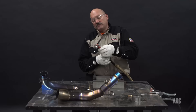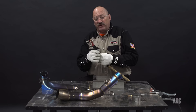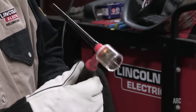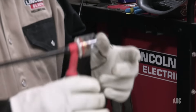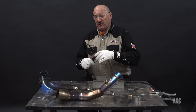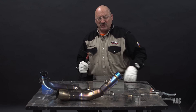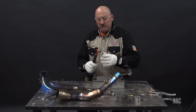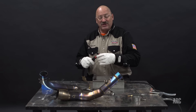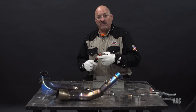For welding, I'm going to use a large jumbo cup — this is over an inch inside diameter, a Pyrex type cup with gas lens shielding. A little higher gas flow than usual; I'm going to run around 30 cubic feet per hour. It's important to have excellent clean, pure gas while we weld. Always check your hoses — make sure there are no leaks and that the hoses are designed for inert shielding gas so they don't add contaminants such as moisture. People doing high-end titanium work in the aerospace industry purchase special gas that has been tested to ensure oxygen, hydrogen, and moisture levels are very low.